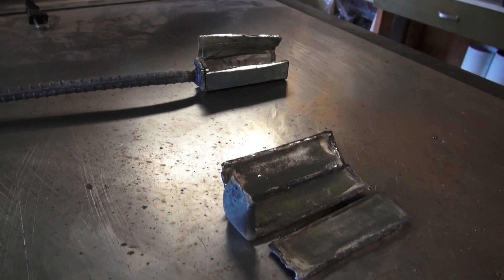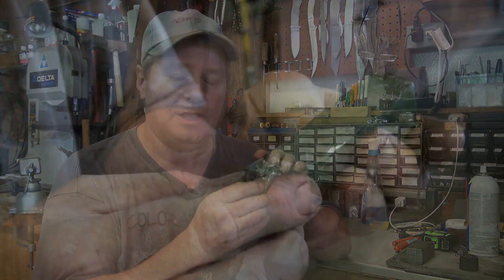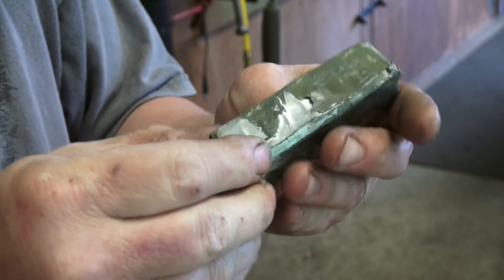Well, did we learn anything? I know I did. The stainless can outperformed the tubing with foil. Now, it could be that the type of stainless foil I was using was not proper. The can was 316L and the foil was 309, and it stuck — it actually stuck to the billet. I've had that happen heat treating stainless blades before and baby powder solved it. The high temperature may be too much for the foil when forging, but the stainless tube out of 316 was unbelievable — the billet just fell right out of there.